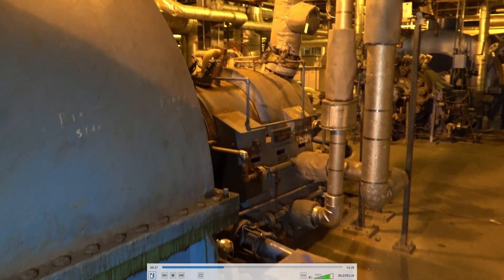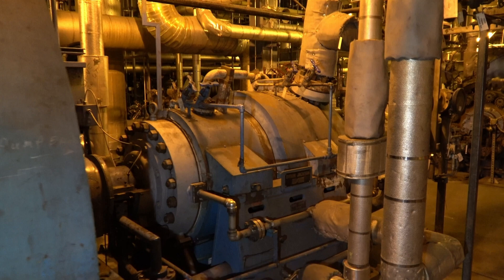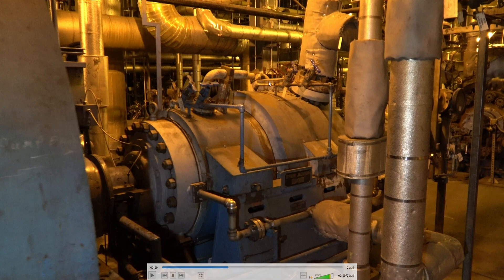This is your main feed pump. This here is the superheat spray — it goes up for spraying down the superheat and also the division walls in the boiler; that'll be another video. You can see part of the cooling water for the seals coming in here. This is the seal end of it; your seals are on both ends.